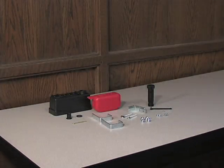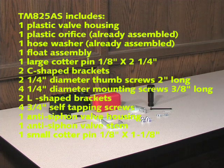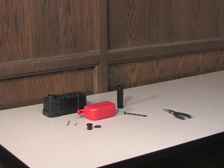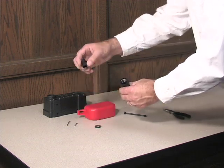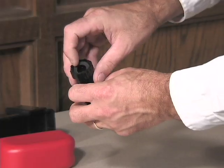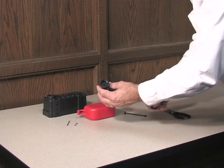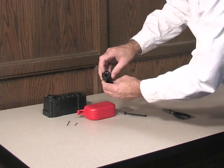These are the assembly instructions for the TM830AS and TM825AS. For the purpose of demonstration, we will use the TM825AS. The TM825AS includes the following parts. Tools required for assembly are a straight blade screwdriver, a Phillips head screwdriver, and a pair of needle nose pliers. To begin, make sure the pre-assembled plastic orifice insert and washer are firmly seated against the anti-siphon valve housing. The orifice should be assembled with the flat side facing the outside of the valve housing. Next, make sure the hose washer is properly installed. It should be seated firmly against the valve housing, creating a seal.